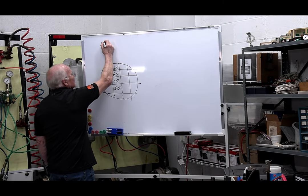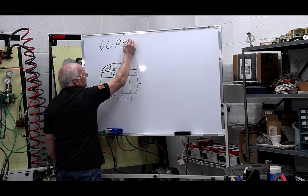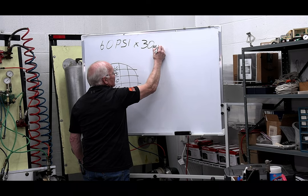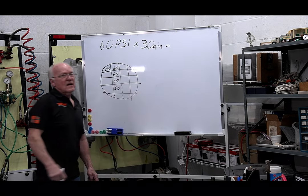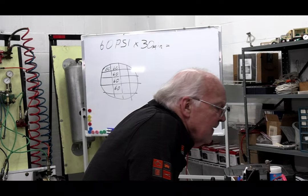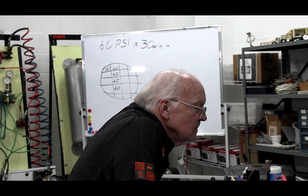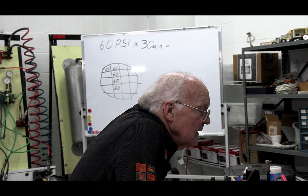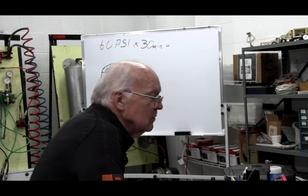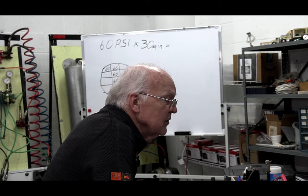So what happens here is you take 60 PSI times 30 square inch. And what are we gonna have, guys? Anybody? I'll walk to the chat for a second here. Anybody wanna give me an answer? Okay. I see so many said 60 PSI, 60 and so on. 1,800 pounds. Anybody else? A couple more so I can get back to board. 1,800 pounds is correct.